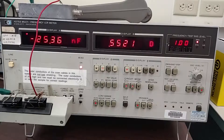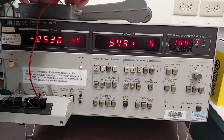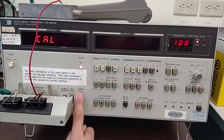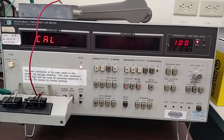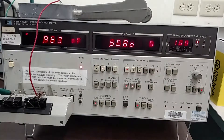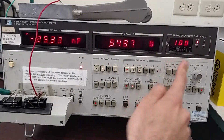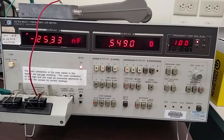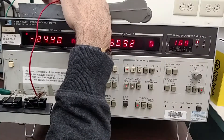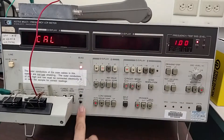So how are we going to use this? I'm going to initiate an open circuit condition. We have some wires, so we might as well calibrate. This is an LCR meter — you could use a impedance analyzer for this test, but this is the simplest instrument to demonstrate on. There are only about 10 frequencies we can apply. Now I'm going to be shorting the electrodes at the top.